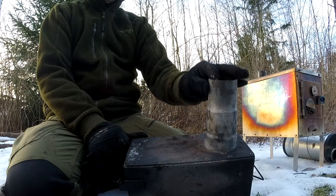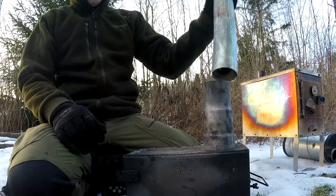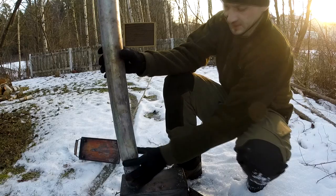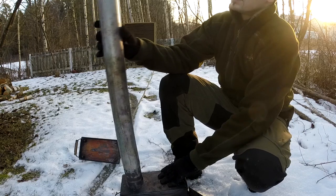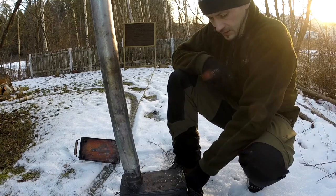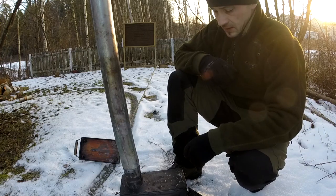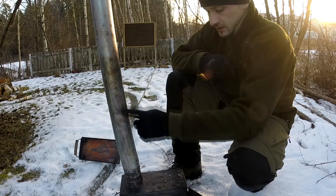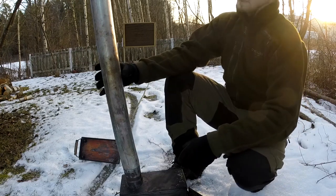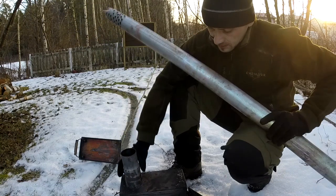The size is two and a quarter inch — the exact size doesn't matter much. The reason I did different sizes is so I can use all kinds of pipes. This is the main pipe for this stove and it fits over very well. It's not a close fit, and that makes it easy to remove. You don't need to worry about the gap because when heating up, the warm air rises. For temporary use it's fine, and for longer use you can have some tar seal inside.